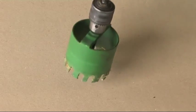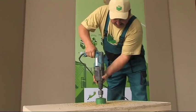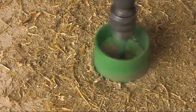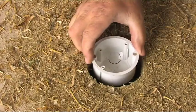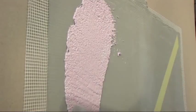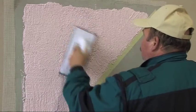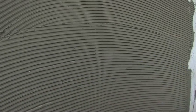Afterwards, holes are drilled for electric boxes and grooves are cut out for cables. The boxes are then plastered and ground over. Water pipelines are installed in a similar way. Interior plasters and exterior facades are similar to those used on traditional construction materials. The straw board is first coated with a bonding primer and done with adhesive screed and mesh.